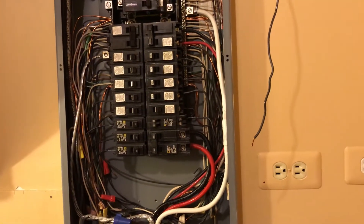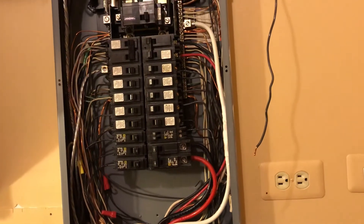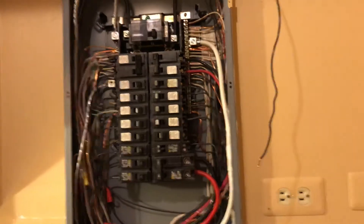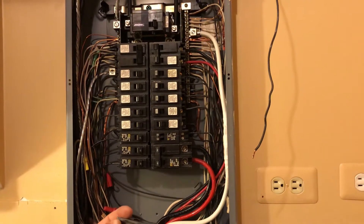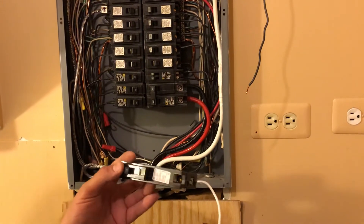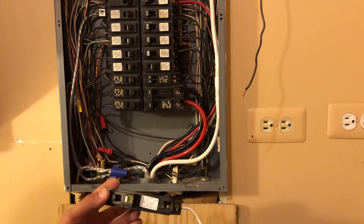The difference between an arc fault — which we're calling an AFCI — and a GFCI, is that the AFCI senses a fault on every leg of the circuit: the hot, the neutral, and the ground. The GFCI basically just senses a fault on the neutral conductor. For the sake of safety for the bedroom, I'm going to put this 15-amp arc fault circuit interrupter breaker in, and that should theoretically, if there's any type of fault on the hot, the neutral, or the ground, open the circuit up and prevent a fire.